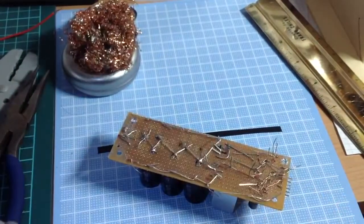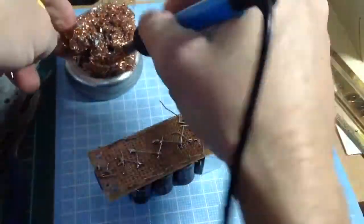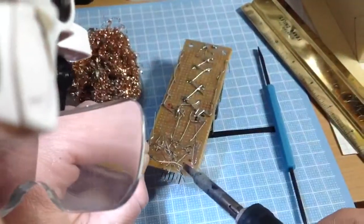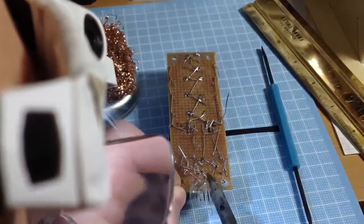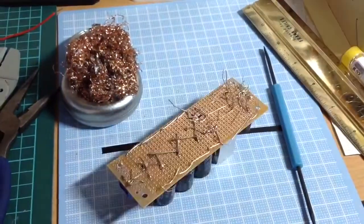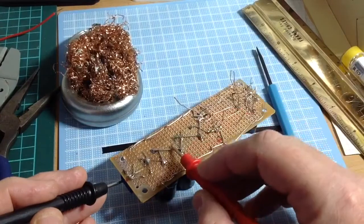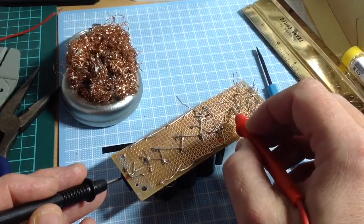It would be misleading to think that all you need is this power supply module to get your power to your modules. What I've done in the past is I've purchased a wall wart that takes the AC 110 here in Japan, or whatever voltage you get in your country, and steps it down to 12 volts AC. So this power module takes the 12 volt AC and then splits it into two separate rails, plus and minus. And the other factor is that if you want to purchase a wall wart, it's going to cost you. So what I've figured out is how to use a step-down transformer to get my power into my module.